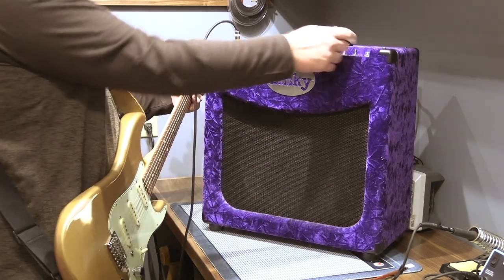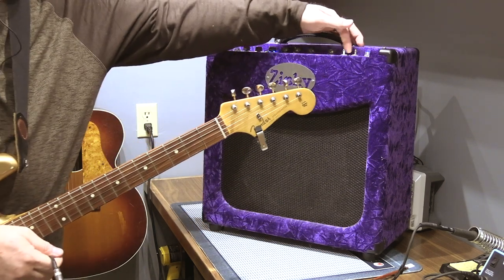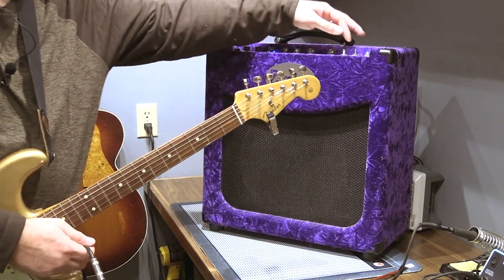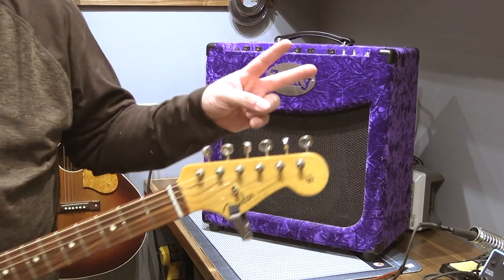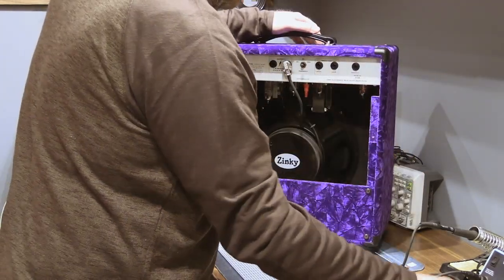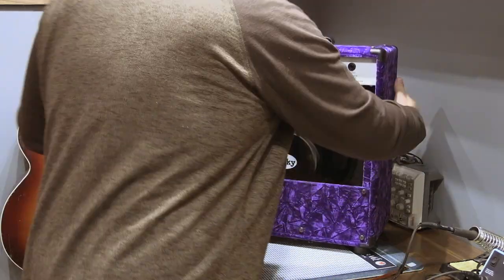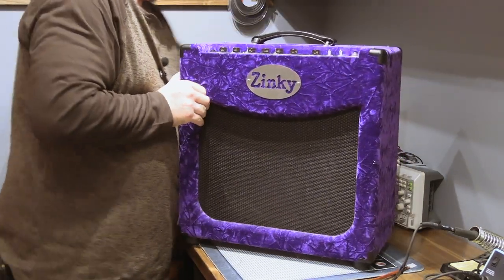Okay, so it sounds better, but we don't know if that valve 2 is the problem, since I'm still hearing a little bit on the overdrive channel, which would make sense if valve 2 is for the overdrive channel. Let me pop a new tube into valve 2 again and give it a listen. That was the old valve 1, that's the old valve 2. This was the new. Okay, now V1 and 2 are new JJs.